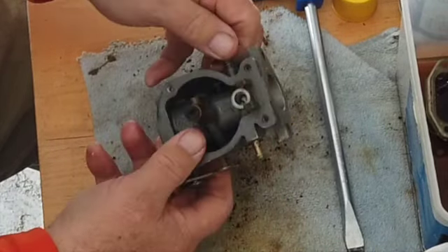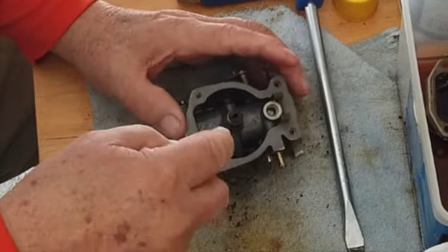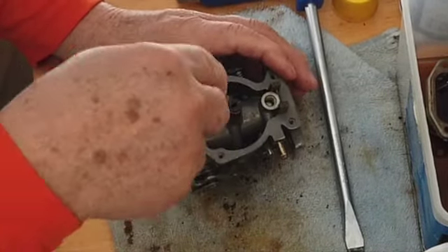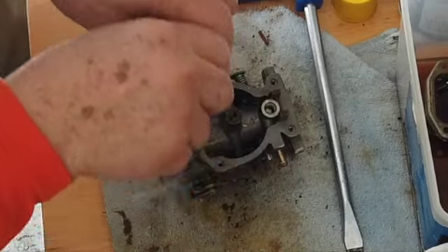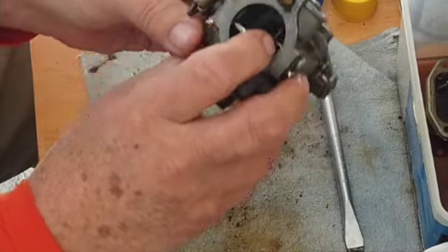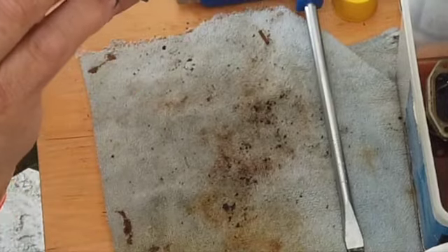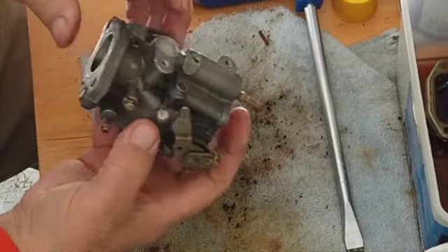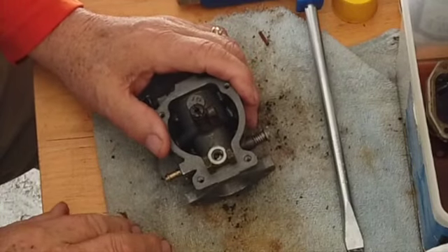The other thing I have to clean out — I called it a needle valve but there's a long needle valve that really looks like a needle. It's in here and gas passes down through it and spreads out. You can kind of see it if you look down in there — you can see that shaft going up and down. That's the needle valve and it has some really tiny little holes in it. It has to be very clean.